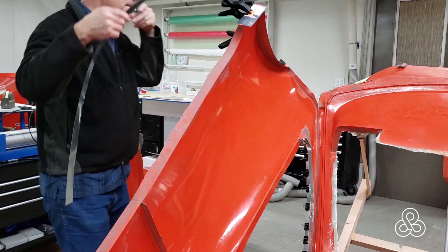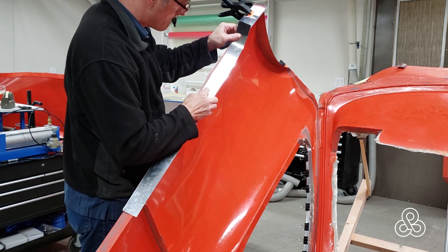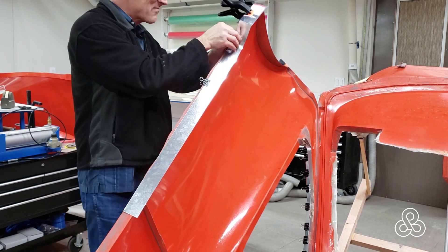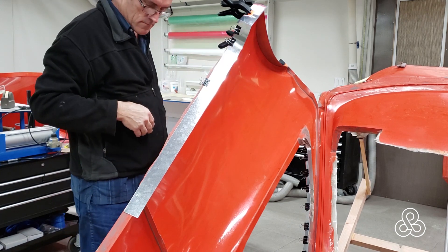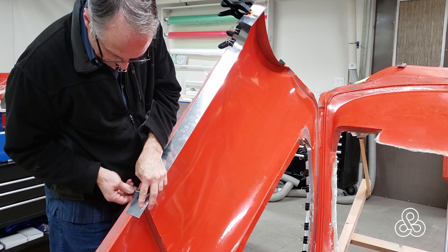Just checking here with my gauge. This bottom edge along the door is critical — it's going to be visible from the outside without the help of the two pinches on the mold. So I'm using the heavier gauge metal so it stays nice and straight. Put that in place.